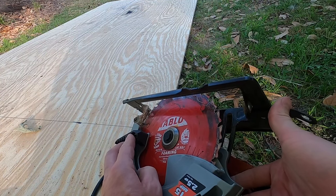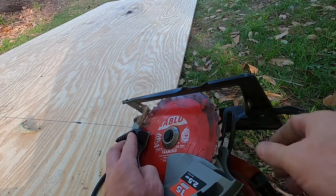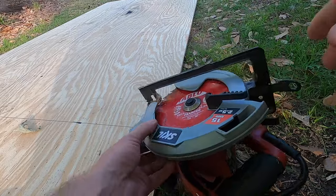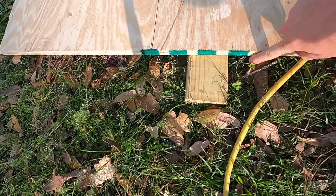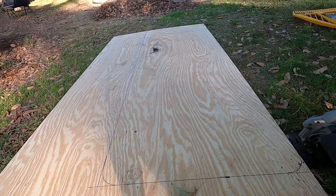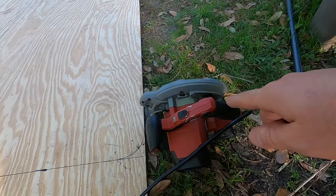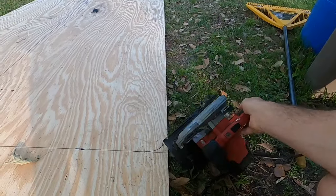This is just going to keep my saw out of the mud because it's raised off the surface slightly. I put a two-by-four under here to slightly raise the board up so I don't have to get sawhorses and all that. That's why I'm adjusting the depth of the blade — so that way it's not cutting all the way through.